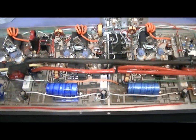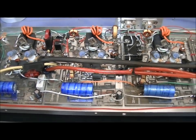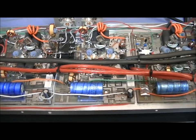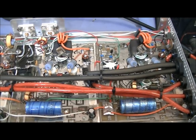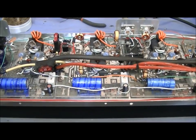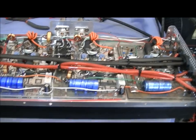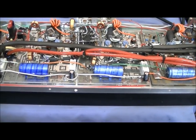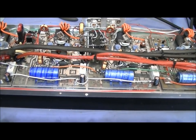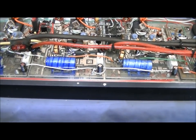So I'm going to make sure never to try to key a Texas Star up or check the bias without the feedback circuits installed. I can't 100% tell you I understand why — it is an RF circuit — but it is what it is. Now I'm going to tackle the fan kit, get your legs installed, get some of that rusted hardware changed out to stainless steel, and get your remote built. This has been a four-day project. Yesterday was spent pretty much figuring out why in the world I was having that oscillation issue.